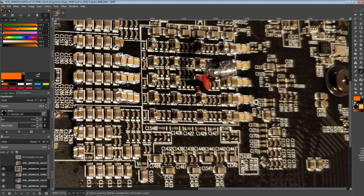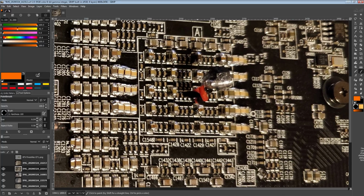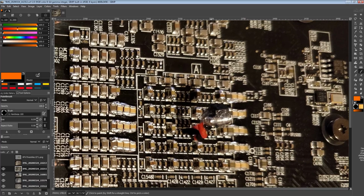So yeah, and I just went absolutely to town on it. The only cap behind the core that didn't get any extra capacitors is the one that the probe hookup goes to, because if I attach a capacitor directly to where the probe hooks up, it's obviously going to make the measurements different. So I will not add any capacitance to where I'm measuring from.